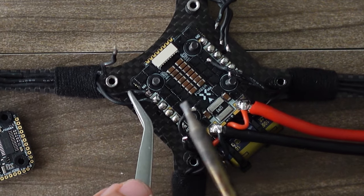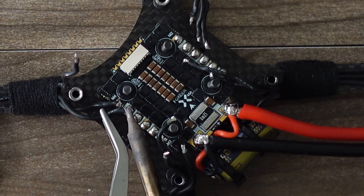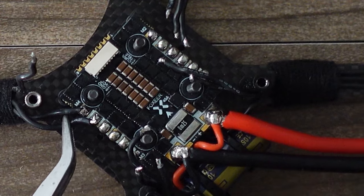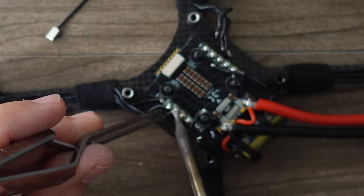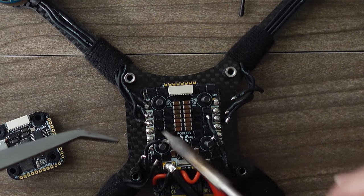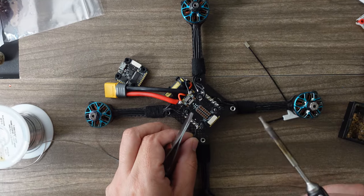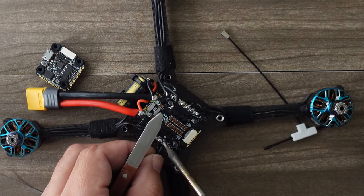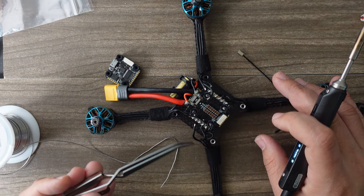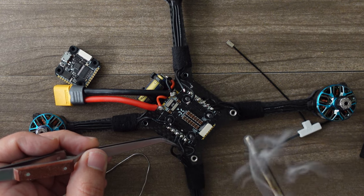For the next ones, angle the wire until it's right on top, apply heat and a tiny bit of pressure so it sinks into place. These don't have to be perfect — you don't want a lot of bare wire sticking out, just keep it as close to the pad as you can. Notice the speed these joints happen — if you do it too slow it won't work well. Once it sinks to the bottom of the pad, let go of the heat and keep the wire there until it cools.